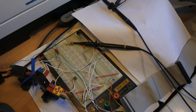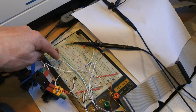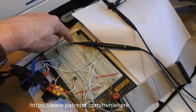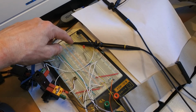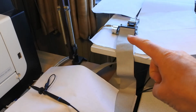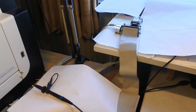However, a few things don't work as expected, and recently I discovered, a bit late maybe after so many attempts, but anyway, that the voltage that comes from this voltage divider is not high enough. So I am trying, instead of this voltage divider, to use a potmeter, and then see if I can get the whole circuit working with a voltage that can be read by the GPIO. Because there's a threshold voltage.